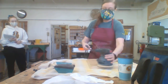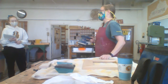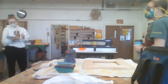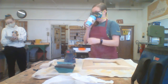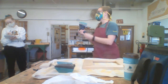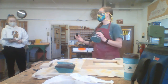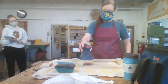What I would do is just let the sander float over the top of the surface. It's really important to understand that you are not shaping with the sander — you are refining a surface. Write that down. By the time you get to the point of sanding, you are no longer shaping your surfaces; you're making them smoother. People tend to really wail on these things — trying to round corners, pushing really hard on the edge. All that does is destroy the pad. Please don't. Just let the thing do the job. You don't have to push too hard, just be patient and move it around.